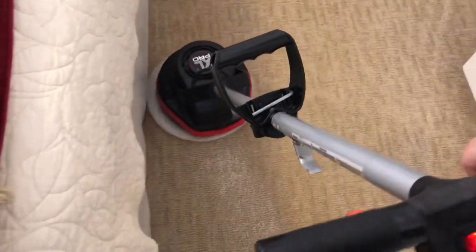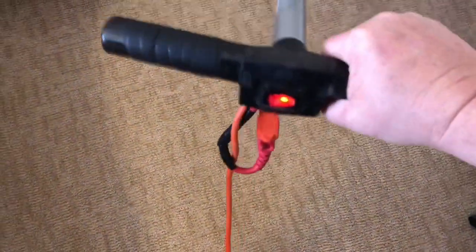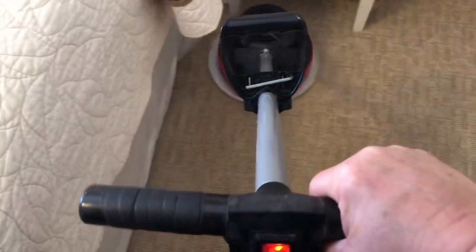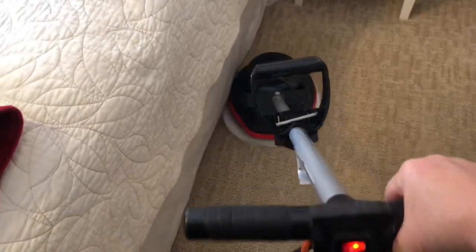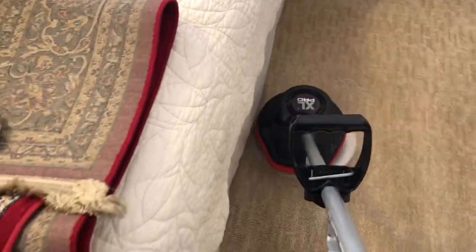In fact, I have some defoamer. It's a ChemSpec product, crystal powderized defoamer that you can actually sprinkle down if you're going to steam clean it. But what I'm going to do when I'm done here, or maybe as I go along after the rooms, I'm going to get some acetic acid and just put it in a 32-ounce bottle, and post spray without diluting it. I know, and it's white distilled vinegar from Walmart. I use it a lot. It's $2.38 a gallon. And I let the customer know.